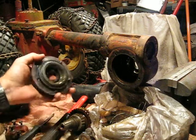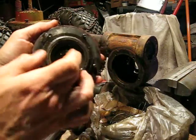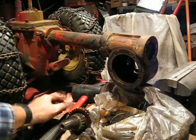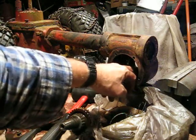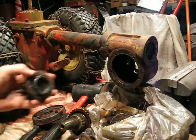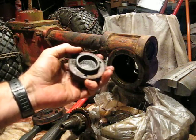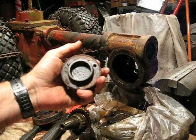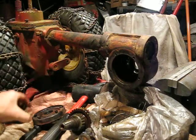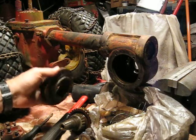On the inside there are two rubber seals that have to be punched out — this one, and then you have to go through here with a rubber mallet and punch that one out. On this piece here for the end cap, there's another paper seal that you end up sacrificing. So I have to order new gaskets and new seals for the rear tines.